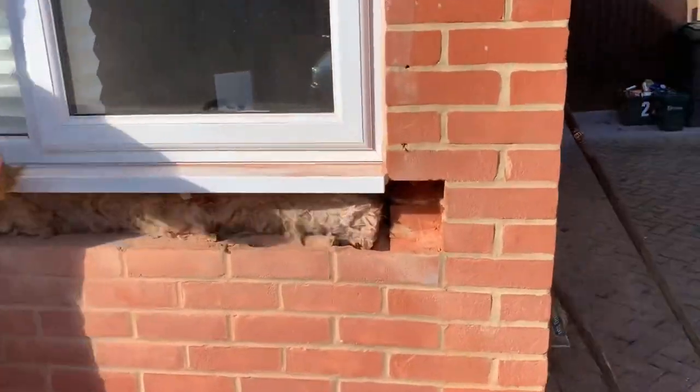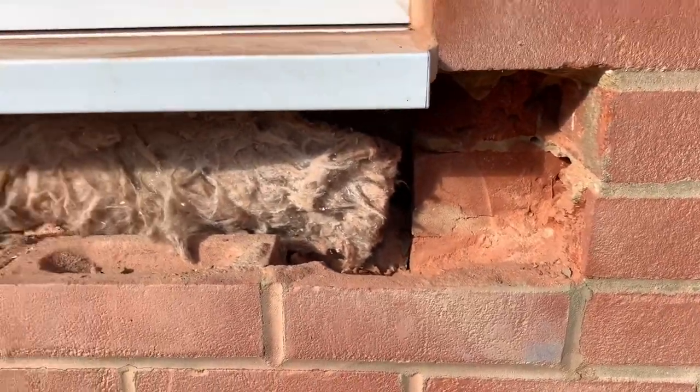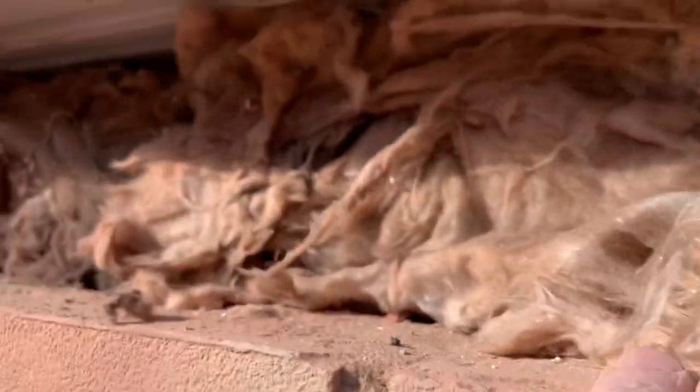Now we've got her out — nice cut in there, which is nice. What they've done is they've screwed the seal down — you can see the bloody screw. So I'm going to rip that back and forth, left and right gently, and eventually let it snap off. I've just done two others. So what we're going to do now is clean up everything, dust off, wet it all down, get rid of all the dust before we point up — because we don't want red dust going into that white cement.